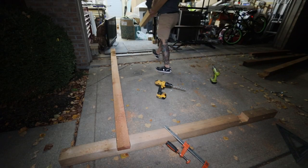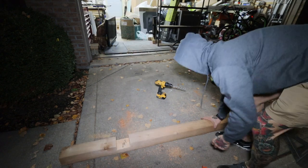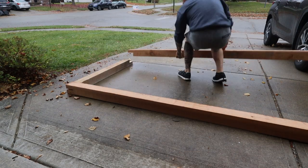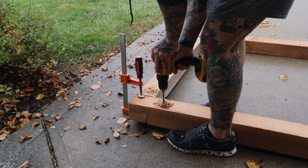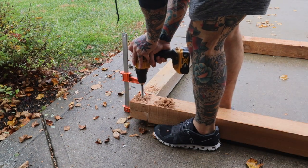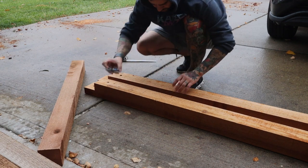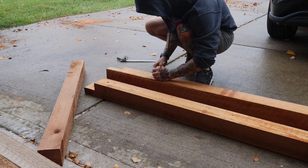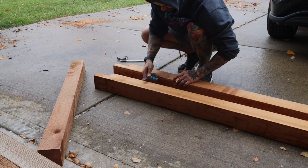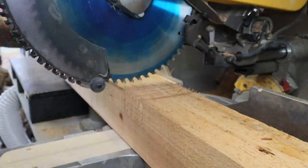I need to pre-drill the holes for the bolts. I lay out the brackets and use a small drill bit to mark the holes, then go through with the auger bit — a 9/16ths auger bit that's 8 inches long. I clamp the joints together to make sure the holes line up on each piece. At this point I'm out of daylight, so I call it quits for the day. I resume work the next day; though it's a little rainy, I'm able to make some decent progress. I've finished drilling out the holes for the T-brackets and L-brackets. I realize I need another crossmember for stability, but I don't have a piece long enough, and I don't want to spend another $30 on lumber, so I'm going to make do with what I have using a 49-inch long piece cut into notches from the rear uprights.